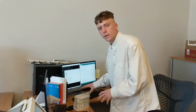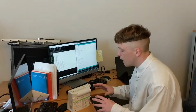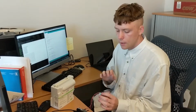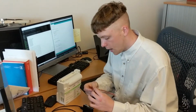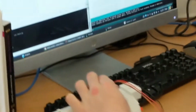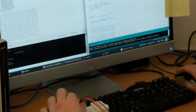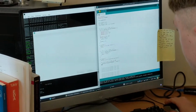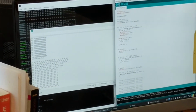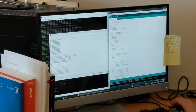So now we can go ahead and return to our setup that we had earlier. This time, instead of reading the EEPROM, we're going to write to it. We'll write to it the hex dump matching a fresh cartridge with a valid checksum, but a different serial number than before. So if we go ahead and plug this in, we should be able to verify, run, and now we've written a fresh cartridge.